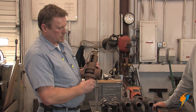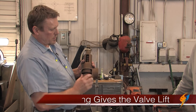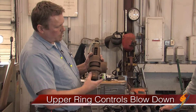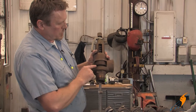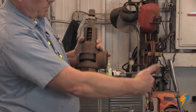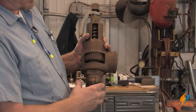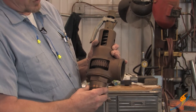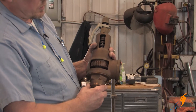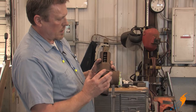What's really critical on these valves — not only is the set pressure, but the ring adjustments. The lower ring gives the valve lift. The upper ring controls the blowdown. When pressure is flowing through the nozzle, it flows in between that lower ring and the upper ring — that's considered a secondary orifice and that's where the flow comes out of the discharge. If these rings are set improperly — these are basically your performance rings — the valve will not function properly and could not achieve full rated capacity lift. So it's critical that when a valve is repaired, these rings are put in the proper place.